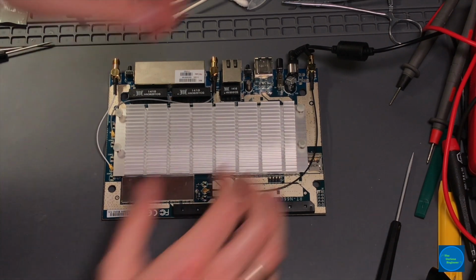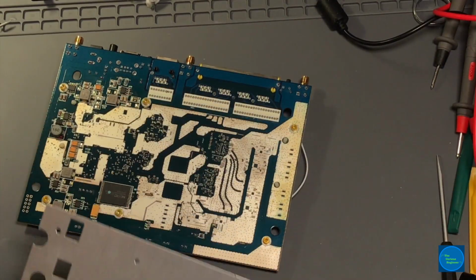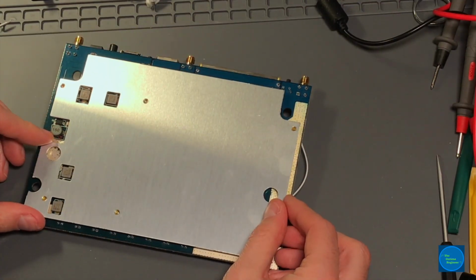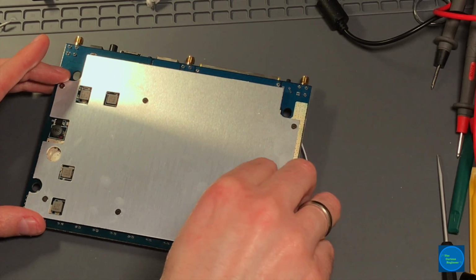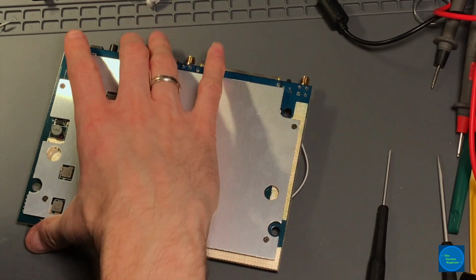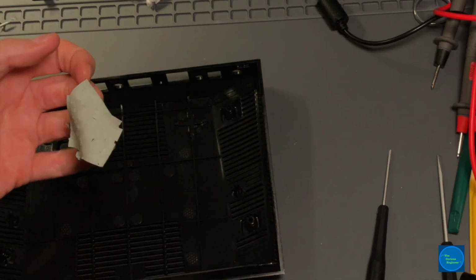So to put it back together again, I'm going to disconnect the DC barrel jack. The shield back on, which I think flips around this way and is neatly lining up with all those 6 bosses. Hopefully you can see them, the gold kind of popping through there. Cool. So we'll take our 6 screws here, and while thermal paste, I'll be the first to admit, is overkill for this, it might just help spread the heat out a little bit better. And these crusty pads were worn.